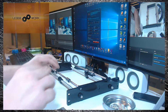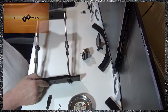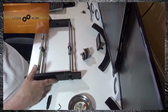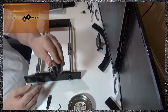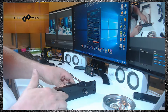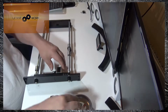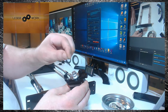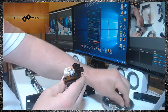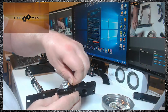And now you need to fit that into our frame. Remember, at the front there's a slot in the back and a smaller hole at the front with 2 screw holes. So you want to take your motor, slide that into the back there, and you can see that it's now flush with the front here. But before you do that, to secure it you need 2 M3 square nuts, and they slot in those little recesses there. You can just about see it there. So slot them in,